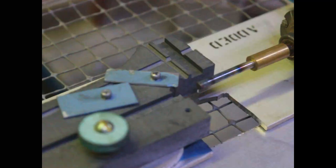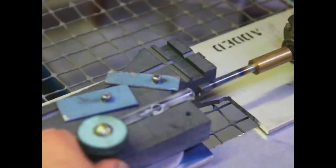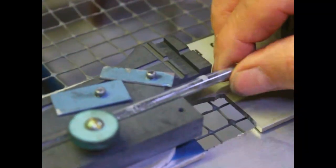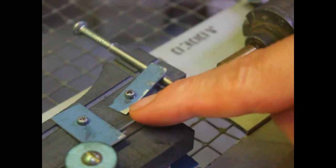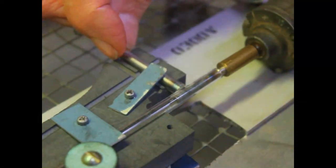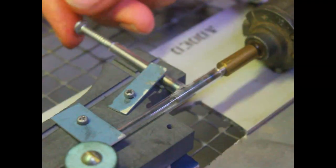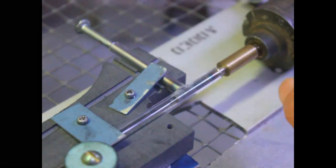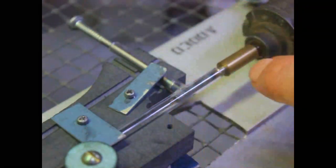Okay, now to put our side tubes on, we have a fixture made up here. And we put our main tube in this part. We slip it onto this mandrel and we align it up. All right, we've got a fixture here. We have the main tube here with the side hole in it, and we have the stem, and that's fit there. We have our mandrel pushed all the way up. And then we have another mandrel that goes up inside, and that one is arranged to rotate so that when the glass closes down on it, it doesn't stick to the metal.